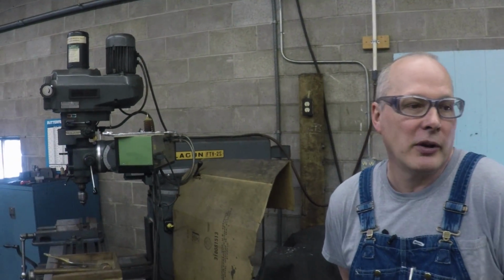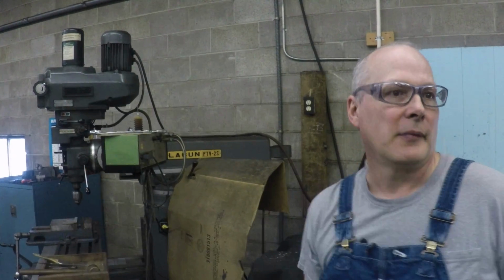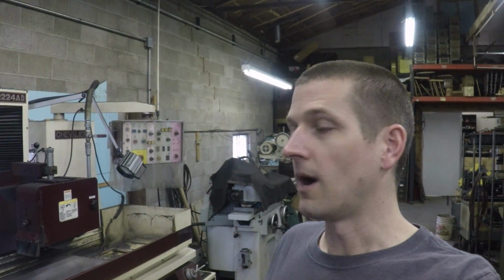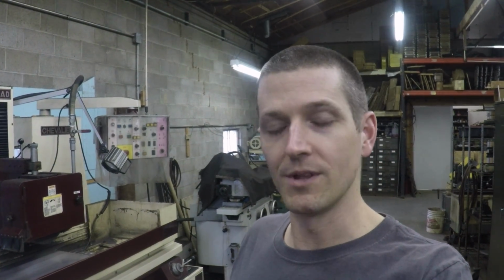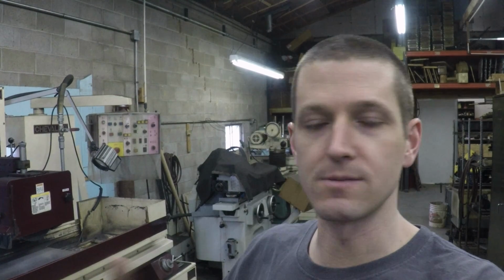But they have videos of them in lathes where they broach keyways, and in mills. Some people are doing it. I can see that where you put that tool in your mill, and go. You've got the keyway in it. You've eliminated the whole operation. Modern Machine Shop had an article that I was reading a couple months ago about this topic, and the folks that make the tools were saying the spindle concern is overrated. It's like a 1/1000 radial cut. It's no different than a small side load or something else. So it's basically all hype, no real facts, and it is a really good way to consolidate a workflow, to do it in one operation. It was pretty cool.